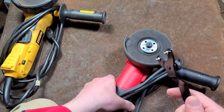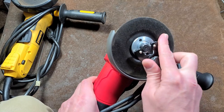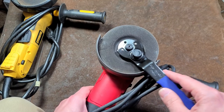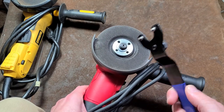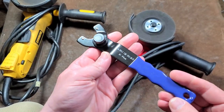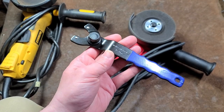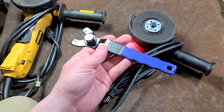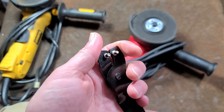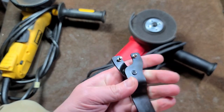It's one of the handiest tools Harbor Freight has for six bucks and a real lifesaver. Even though I have the regular wrenches, it's nice to have one of these for situations where you may need an adjustable pin wrench. It comes with a lifetime warranty and spans 10 to 30 millimeters — roughly three-eighths of an inch up to about one and one-sixteenth inches — so it has a reasonable range.